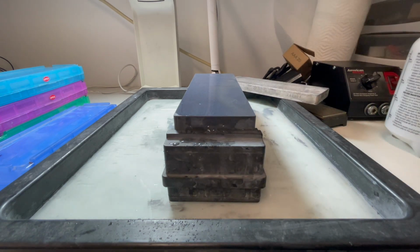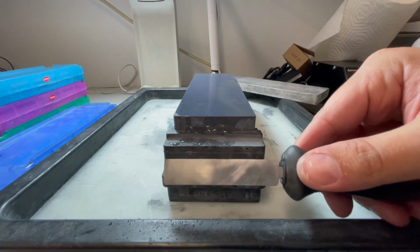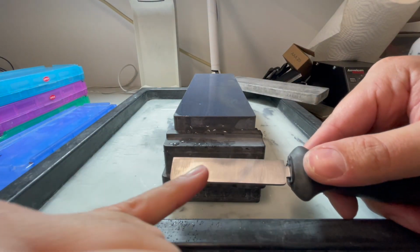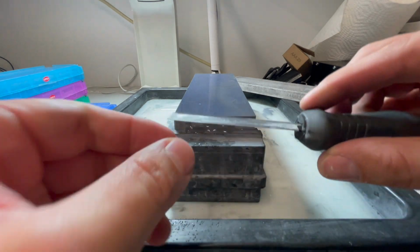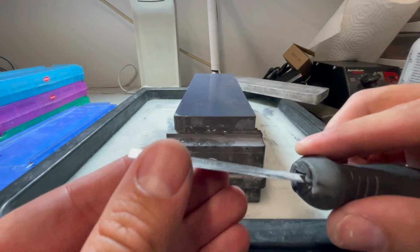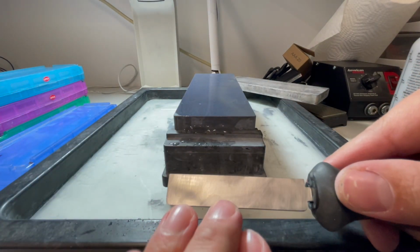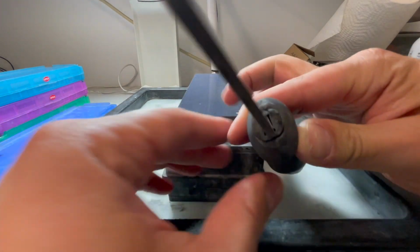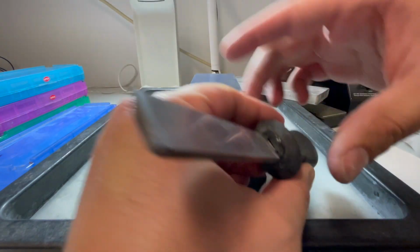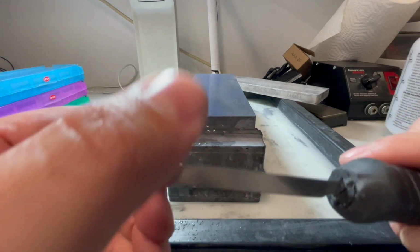So I kind of jumped right into this, but my goal is, can I get that little notch to clear out? We're making some progress. The Sharpie's gone. It's pretty flat, but I want to make sure the burr, wow, this is fascinating. I can feel the burr here escape. So I'm taking steel off this side of the knife, and almost like water trying to escape the back of the knife. As I sharpen here, the burr, the edge of the knife, starts rolling over. And I can feel, maybe you can hear that, it's kind of grabbing here.